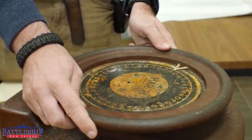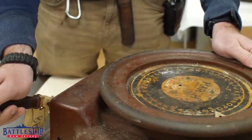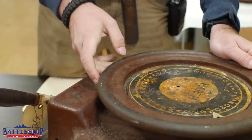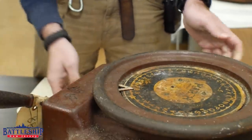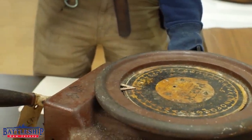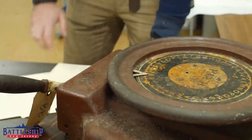And then you would want to do a space, which is just push that down enough to move it but not enough to punch. And then I want a two — look, it didn't move it there. So two is probably having an issue on this machine. Eight — that didn't move it either. We might be jammed up here. So let's try and open this up and see what we've got. Yeah, we got the F, we got the space, and then the eight and the two weren't actuating. So there might be something jammed up in the rollers here. Maybe that's why the museum was able to acquire this — because it was no longer functional.